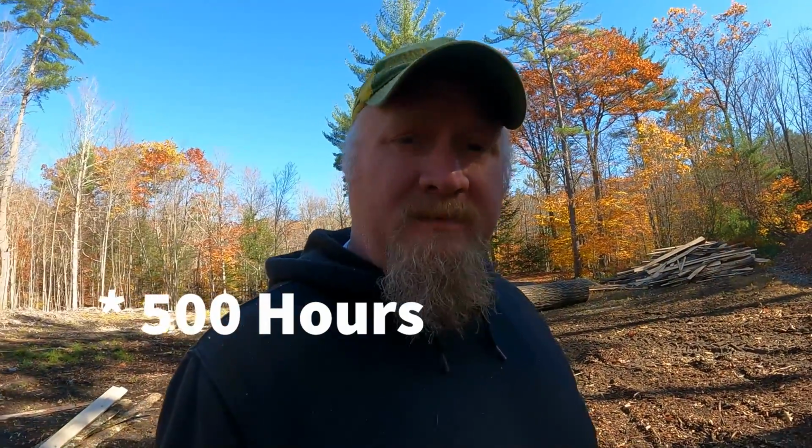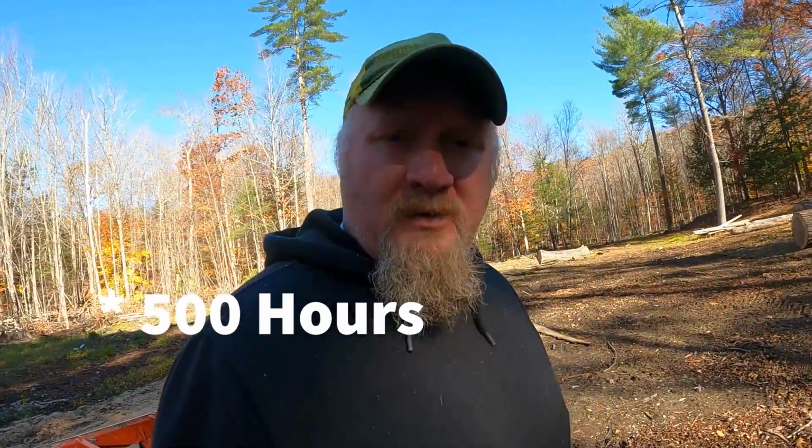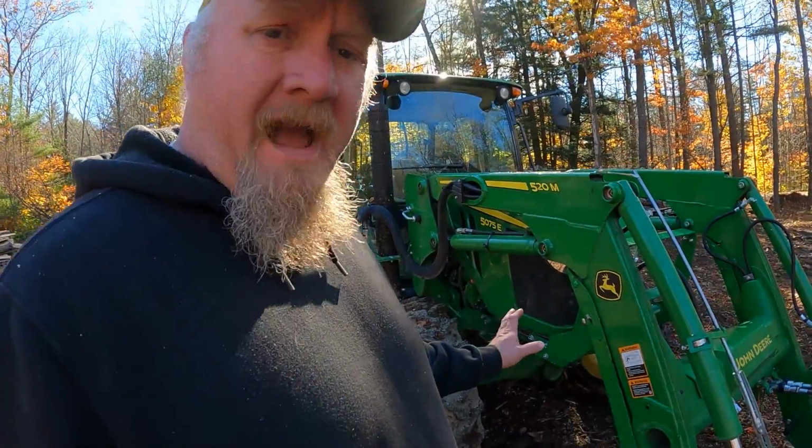We did use the premium John Deere oil. The book says you can go, I want to say it's 300 or 350 hours between oil changes. I'm going to do it probably every 150 hours, because I do work this machine hard. I bought this tractor to work it, and I have worked it.